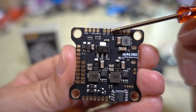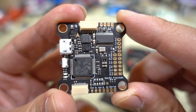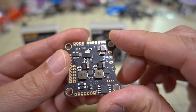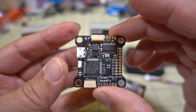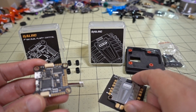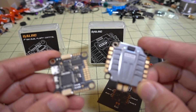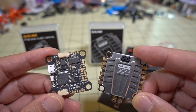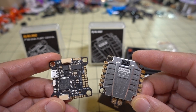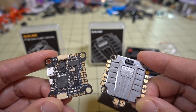All those connections are also available underneath, but there's no silk screening on the underside so you have to reference the top of the board. The ESC solder pad connections are available on this side too if you prefer those over the pins. It's a pretty basic F7 board without a lot of frills, but it does have nice 5V and 9V regulators for clean video. I'll probably put these together in a future build — likely a 5-inch quad since I'm limited to 5S on this ESC. If you have suggestions on what to build, let me know in the comments below.